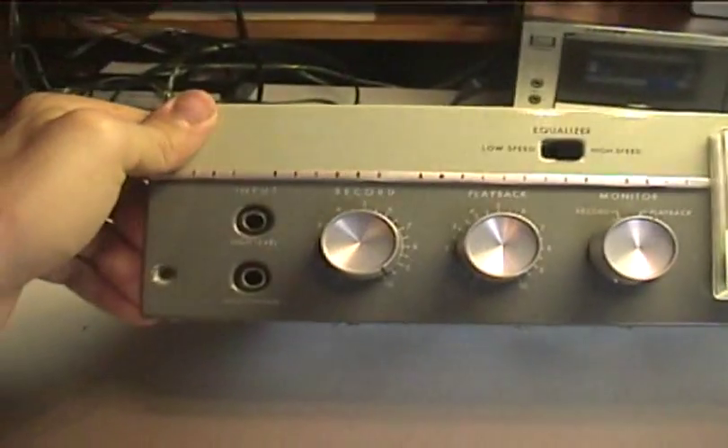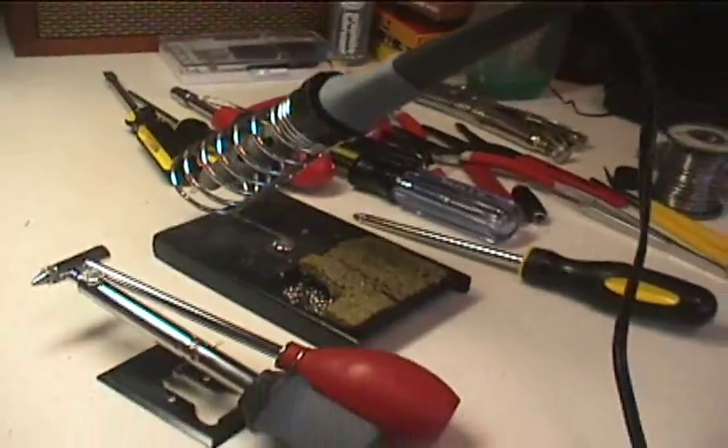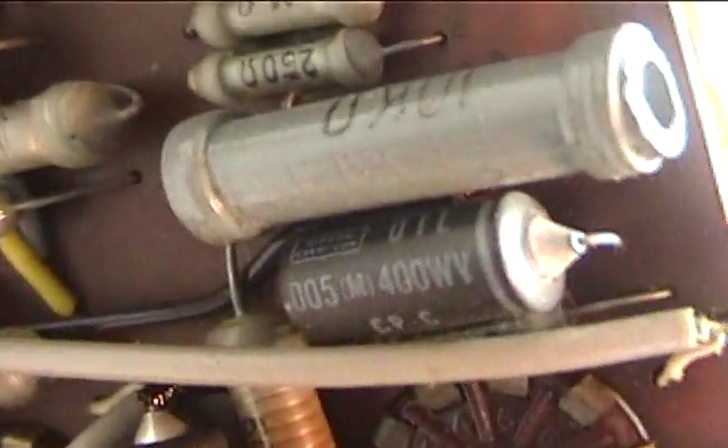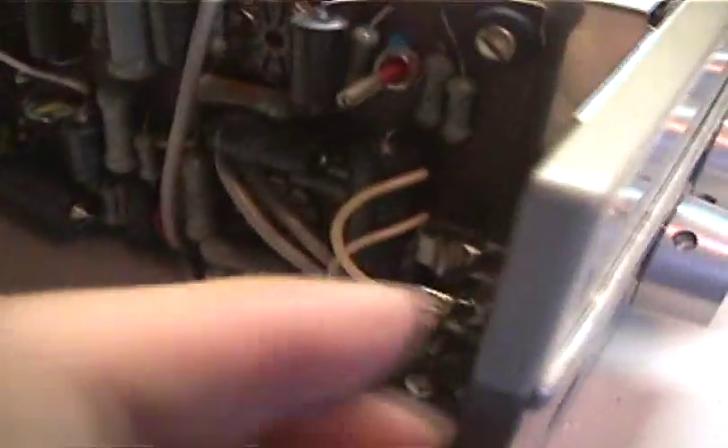Here's the amp before recapping, out of the machine of course, with the cover on. The tools are a desoldering iron and a soldering iron. With the top cover off, you can see the original capacitors inside. There's a type of All American 5 — these are the oil capacitors, labeled O-I-L. Those black ones look so much like electrolytics, and then of course there are actual electrolytics too. I'm wondering if these burnt resistors are possibly bad as well, because there are some burnt resistors.